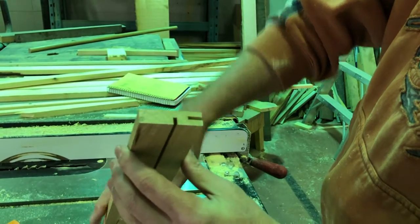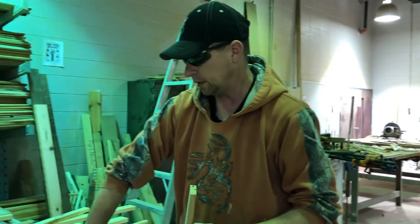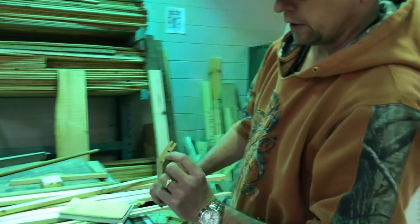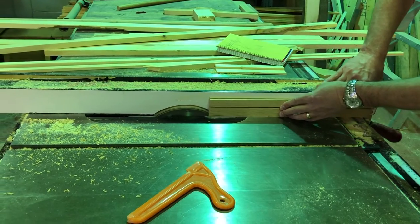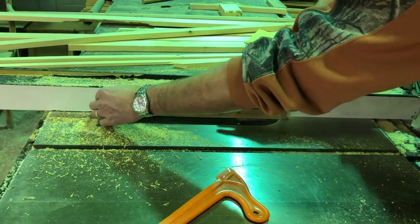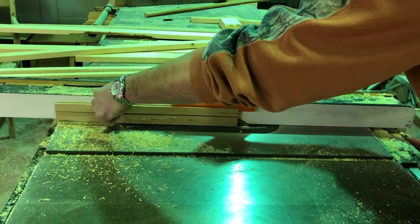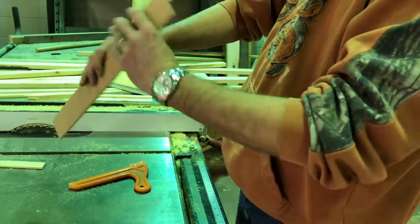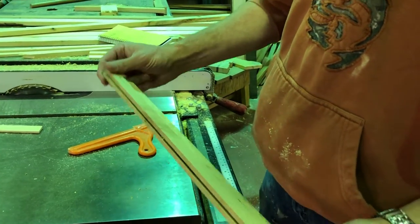We've just made that little indent, and now our next step with the table saw is to cut out this top portion entirely. Set the blade at three-sixteenths to the fence and the blade depth at one inch, and run this piece off — getting rid of the excess space. What you've just created is this nice long piece of hardwood in exactly the right shape, and you can cut as many strips to the width you want to make multiple triggers.